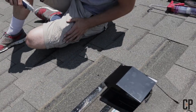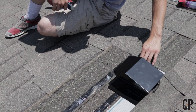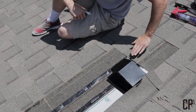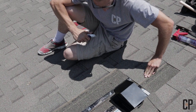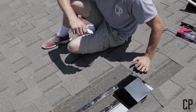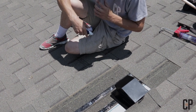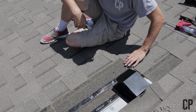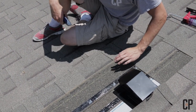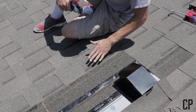What I'm doing here is getting ready to cut this shingle because it needs to lay underneath the vent. The shingle obviously can't lay in the hole where the vent goes through the roof, so I'm going to have to cut that area out. I want to keep it as close to that hole as possible so water isn't able to get in, and the vent will be able to rest on it so water can run off.